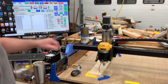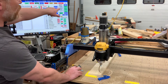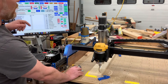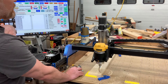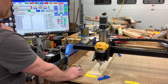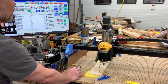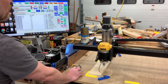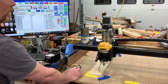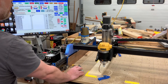When I move these coordinates — I'm going to move over to the left — that went up by one. If I come down, that goes up by almost one. But if I want to go to zero, zero is where I was before. Now I go back to zero, and for each one of these work coordinates you want to get to zero to get to those positions. I have no idea what this negative 23 is — I didn't set up G59 — it's probably somewhere off the table.